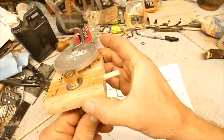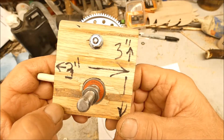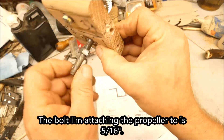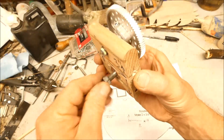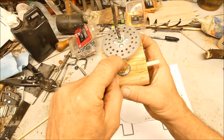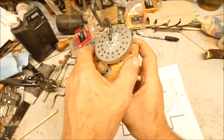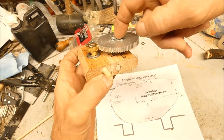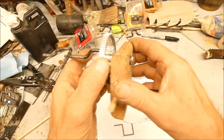I wanted to explain how I made this setup because I did it a little differently. First of all, I got a piece three inches by three inches. This bolt is a 5/16 inch piece of steel rod that I threaded — the whirligig is kind of heavy so you need something pretty stout. I got 3/16 inch rod, drilled this one first, put the gear in there in the bearing, then set this one on there and made a mark where the center was and drilled a half inch hole through this wood.